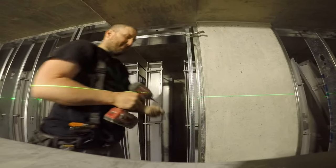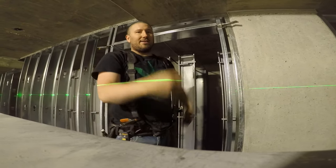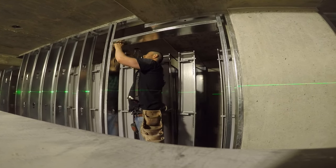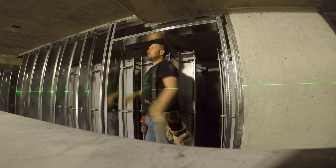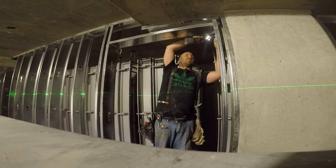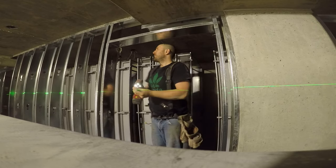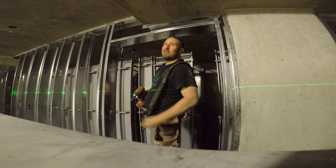I'll do one on each side to start, clamp the other side, and then put the front ones in after. You can see the studs are wrapped nice and tight, and then just to finish, put a couple on the inside here. You could put them on the outside too, but for drywall this is the easier way — less stuff getting in the way of the drywall when it goes in.